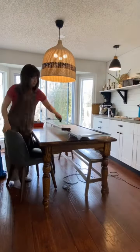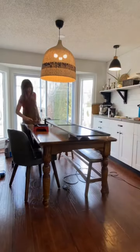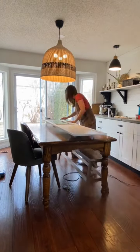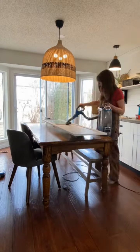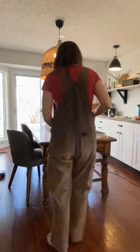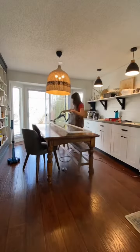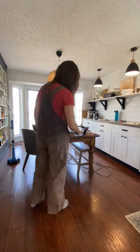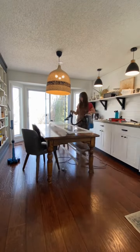This will ensure a really smooth finish. The temptation when you're doing a project like this is to do a really heavy first coat of paint, but it's so much better if you do multiple light coats — it makes for a much nicer final surface. Be encouraged: if you work on your own DIY projects, sometimes they take much longer than we hope they will, but they are always worth it in the end.